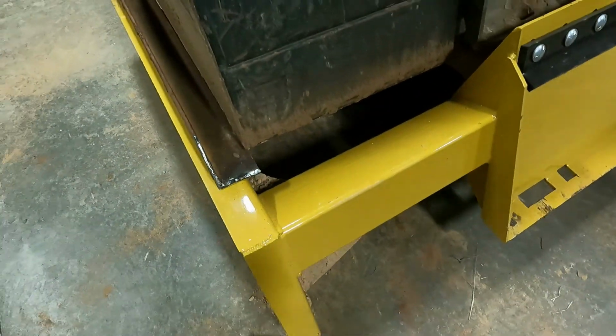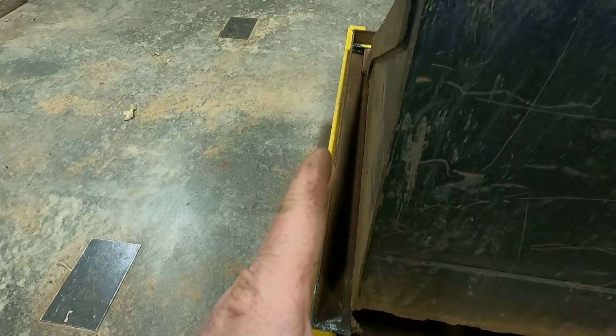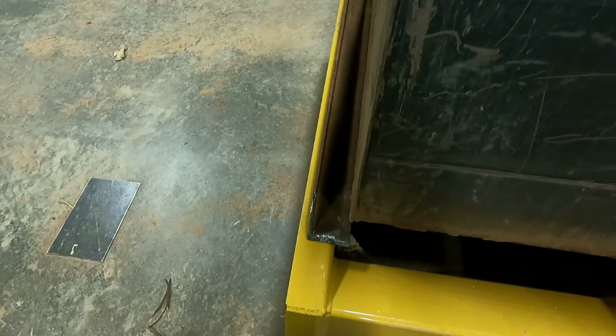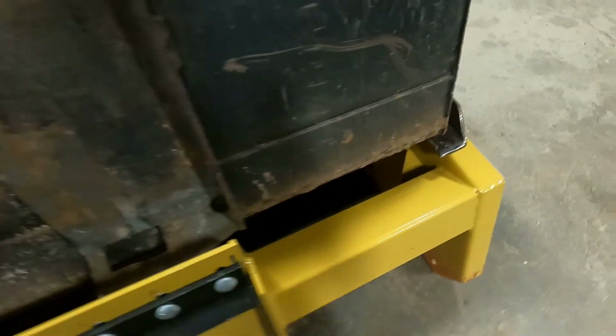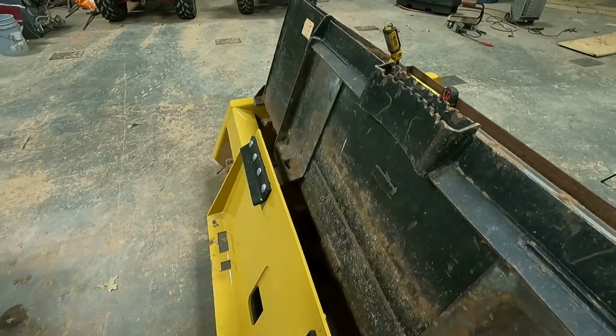When I first put it on there, it actually fell through the crack. So I think what I'm gonna do is I'm gonna cut these tacks loose. Instead of having it at a 90, I'm gonna take it to about, I don't know, 80 something and burn at least 1 inch, because rolling down the road, if it moves over this way, if that front corner comes back at all, it's gonna fall down.